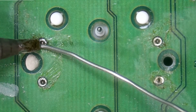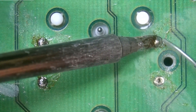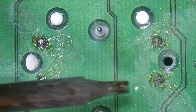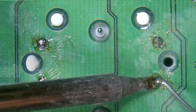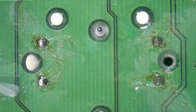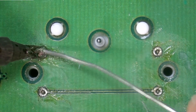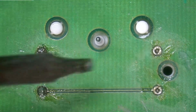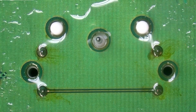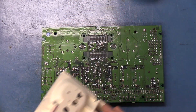We can go ahead and start soldering our replacements in. This is the one with the loose soldering joint. What we want to make sure is that we're getting solder inside of that joint because that top piece is loose. But the joint internally should still be good, unless it's a no-connect, in which case there's probably nothing inside of there. We're going to give all of it a little clean and remove some of that extra flux. Now we should be able to put everything back together.